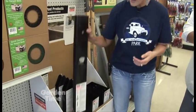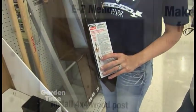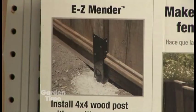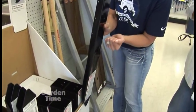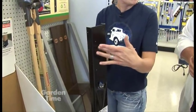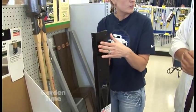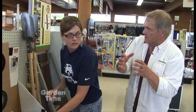These are easy fence brackets. The idea behind these is that you would go up right next to where your post has cracked or fallen over, get this driven in right beside it, and drive that in with a mallet. Then there's a bolt hole for you to bolt the post to this bracket. If it's really a bad break, you could do that on both sides to really shore it up. You just need to square your post up and level it.